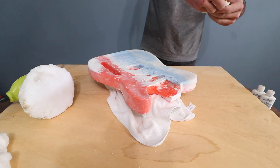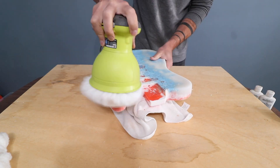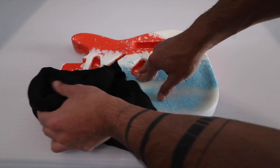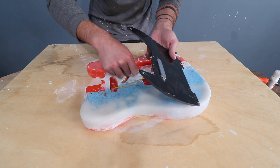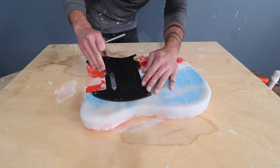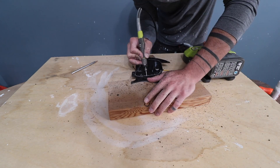I've seen a lot of really shiny epoxy guitars, and I didn't quite want it to be that polished. So after the 400 grit, I just went right to a buffing compound and buffed it out. This way it has sort of a sea glass plastic kind of look. This acrylic plate that came with the kit was a little bit too big for my purposes. I didn't want to cover up all this plastic that I had worked so hard to produce, so I just used my Ryobi rotary tool to cut it down.